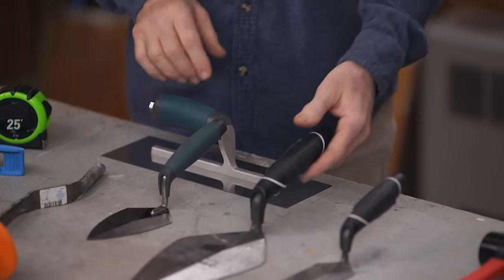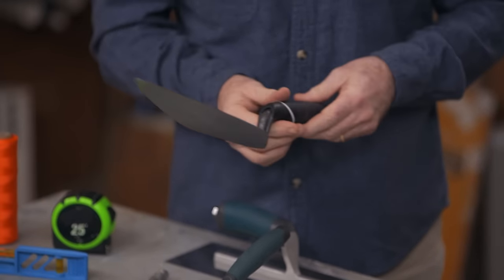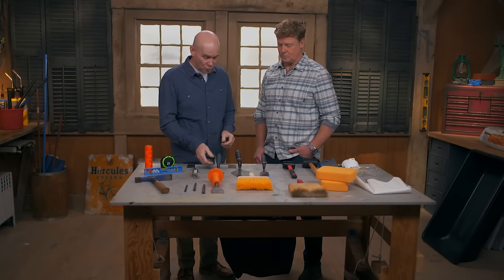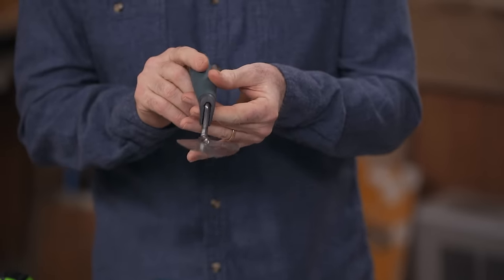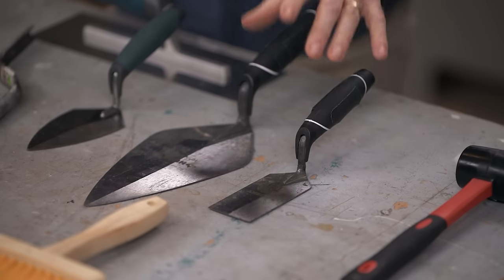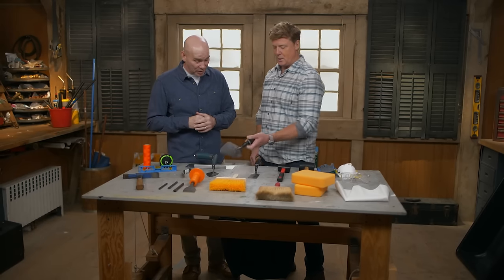This right here, of course, you know that is your brick trowel. So if we were doing a step repair or even a stone wall repair, this is our tool. This is a 10-inch trowel — that's very typical of what even a mason would use. This trowel, again, you can see it's much smaller, but you can see that angle in there — that's going to allow us to get into all the nooks and crannies that we need to. This right here is called a margin trowel. Some of the stone joints that we are going to be taking out and putting back are wide, so that tool will come in handy.